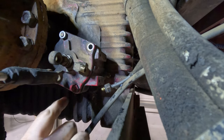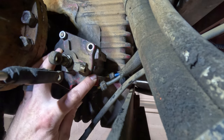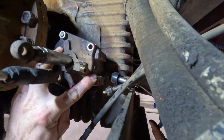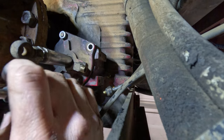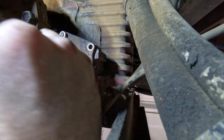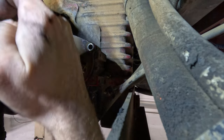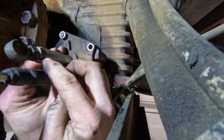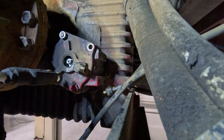The front airline pushes the shaft inwards and locks the rear driveline for road mode. The rear one — when air is applied — puts it into pump mode. We've already pulled the cotter pin out of our manual pump shifter. Pull this two-piece shaft out — usually it's an 11/16 wrench and you can turn it right here. I've already got it loose. Clear your shaft out, set it aside.